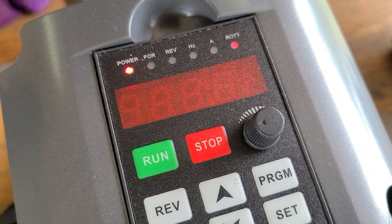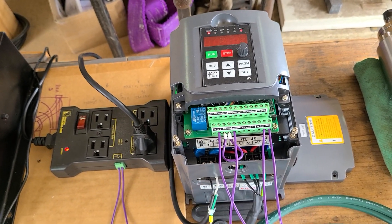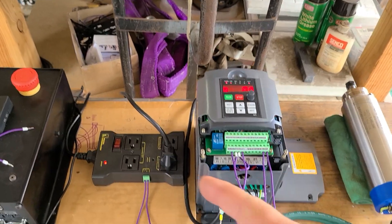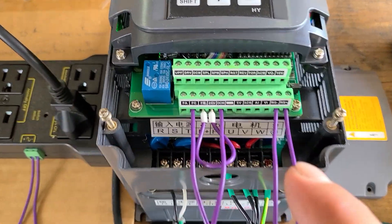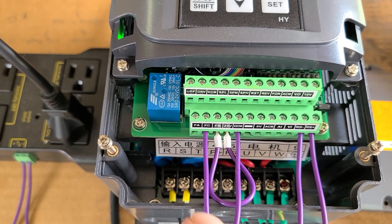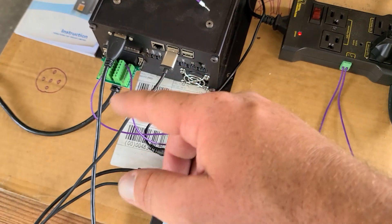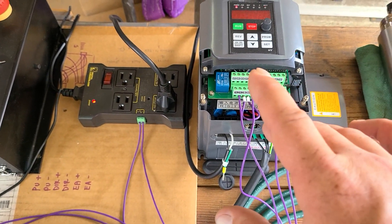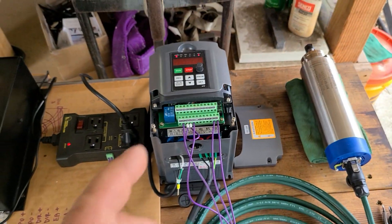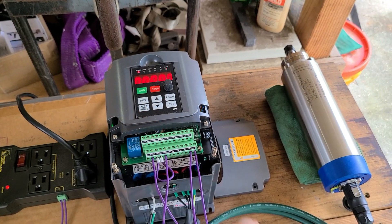And it clicks off, because it's less than the base frequency — whatever that setting was — that I chose for this to click on and off. Easy way to make the IOT relay work out. The great part is that these VFDs have a 10 volt output, a 5 volt output, and a 24 volt output, so you've got three different spots you can use to bring power from the VFD to trigger a relay to click on. You don't have to hook anything up to anything here, and you know that when the spindle clicks on, your dust collection is going to come on. Alright, Grant Davis, everything's working — you're good to go. Any more questions, hit me up, I'll help you out.